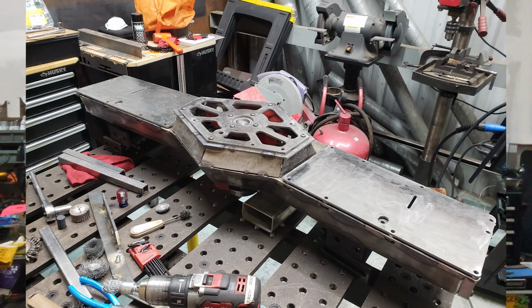You see, what had happened was, in 2019, when we set out to build the very first HiJinx, one huge recurrent design requirement that we all agreed upon was serviceability. The robot has to at least be kind of easy to work on, and this informed our armor panel shape decisions. The version 1 HiJinx and the current design have a massive block of machined aluminum as the base of the weapon stack. Chongus. Inside that is a steel sleeve, and then there are bushings.